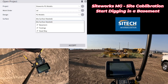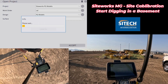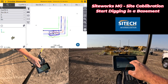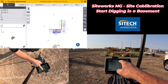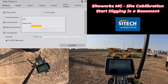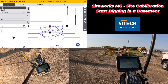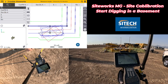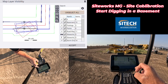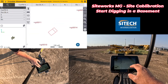Now I can pick which design I want to start with — we'll go ahead and start with the basement. There are three different surfaces. The storm drain isn't an actual model but line work that's in there. Right off the bat there's my control around the project. I like to hit the gear and turn on point name so I can see the names of the control points on screen. It's a cluttered mess in the middle with the roadway, footings, and basement all stacked in the same spot. I can hit layers on the right side, unselect all, then check on just the basement to clean up the screen while keeping my control points.